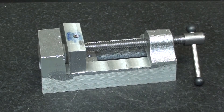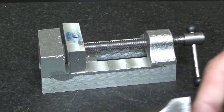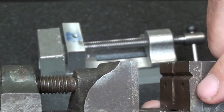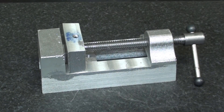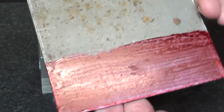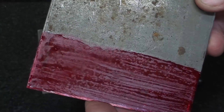Hello once again, it's Vice Man, Mr. Pete, your YouTube shop teacher. This is part three of my build on the small Peterson Products drill press vice. I'll finish it up in this chapter. The first thing I'm going to do is to make steel jaw plates for the fixed jaw and the movable jaw, much like you see in this sample vice here. Notice that this one is thinner than this one because a V is put in there. I'm not going to do that — both of mine are going to be the same. They'll simply be made out of eighth-inch thick cold roll steel that I had laying around the shop, and I've already blued or dyed one side of it. I'm ready to start laying it out. Let's begin. Thanks for joining me again.